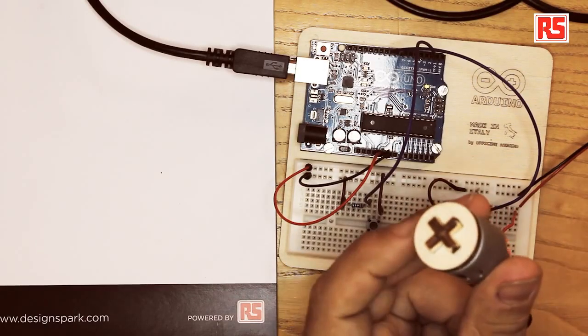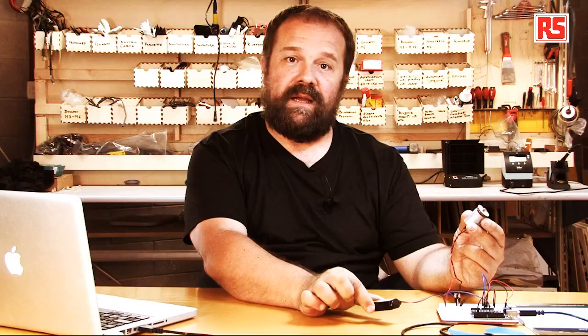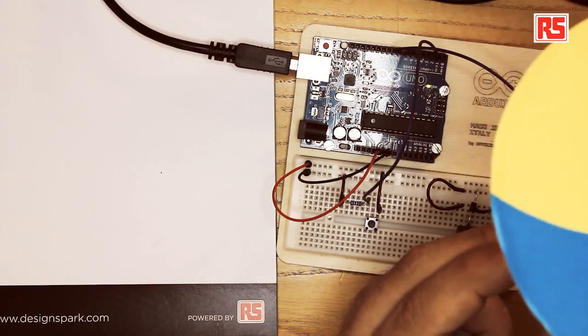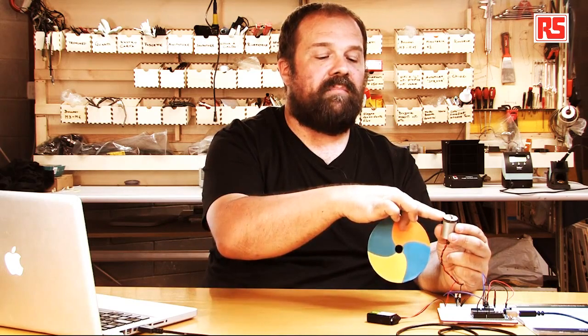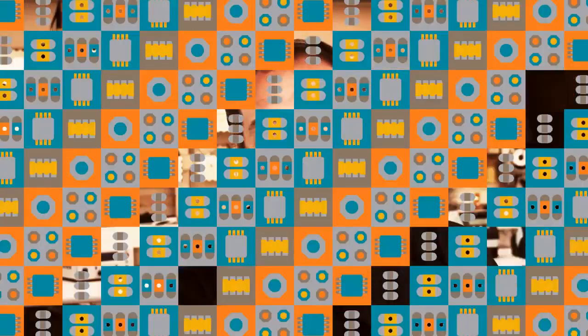The DC motor is a simple electromechanical device that you see here, normally powered by a 9-volt battery. We're going to be building a circuit that lets Arduino turn on and off this motor, and we'll be using that to control a color wheel manufactured using an old CD. The DC motor works at more than 5 volts, which is the standard voltage Arduino operates at, and it requires more current than a single Arduino pin can provide.